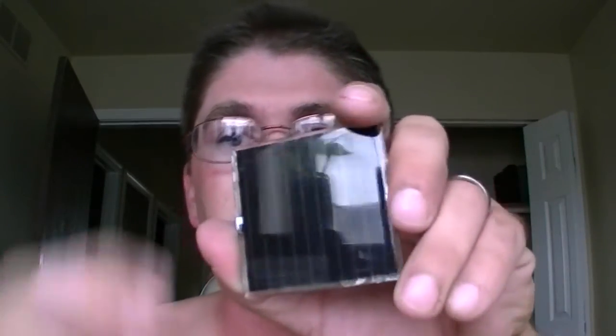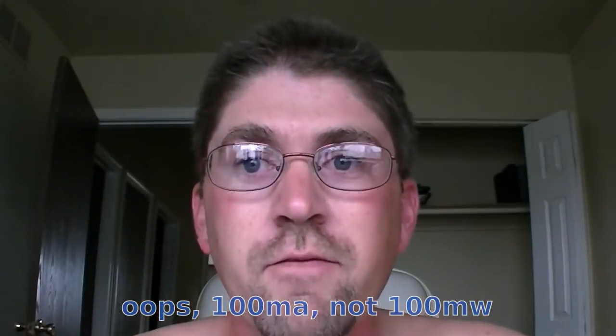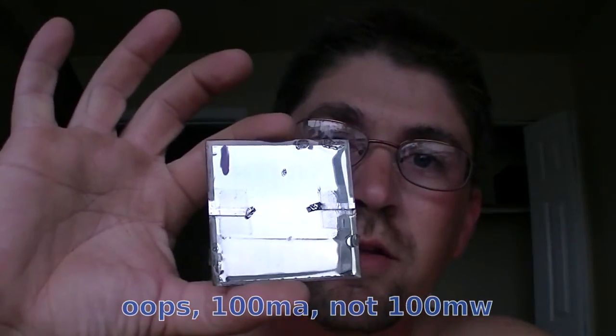And the solar panel — it is a 100 milliwatt rating at 4.5 volts. It has two little leads on the back of it. It's manufactured by Shell Solar. Of course, we're not going to be running at those voltages. I've tested it on a multimeter in the milliamp rating, and this still puts out roughly about 40 to 50 milliamps at about 2.3 to 2.5 volts. It charges the supercapacitor perfectly fine. On a full sunny day it probably takes about six or seven hours to charge.